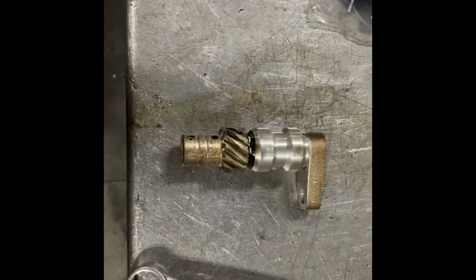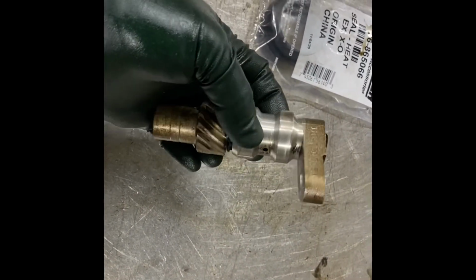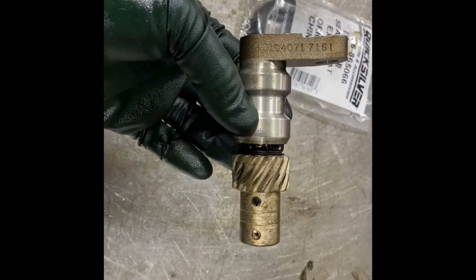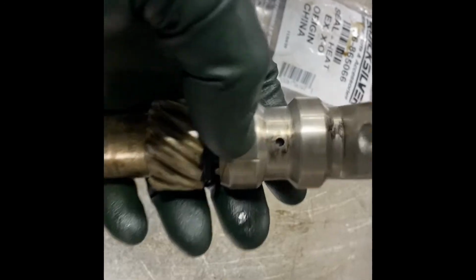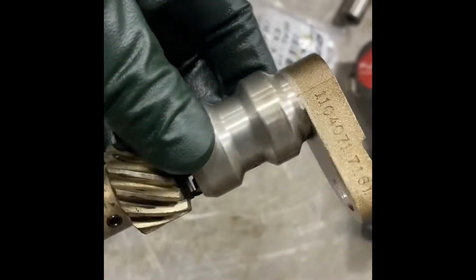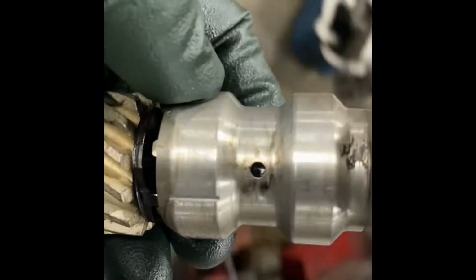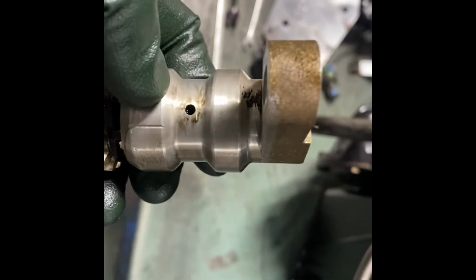Okay, a minute ago I was talking about the oil galley going right through this little distributor drive. Now on an 8.1, since there's no distributor, they have this little guy that goes in the intake manifold. It's basically like a quarter of a regular Chevy distributor, and it runs off the cam and drives the oil pump. That's what that little screwdriver drive is. But right here, see a little oil passage? That actually keeps oil inside this unit so it doesn't tie up and go to hell. This big groove my thumb is on goes into the oil galley. So it's kind of half-ass seals here, half-ass seals here. That way the oil is forced through this guy to keep oil through it. So interesting setup on how these work.